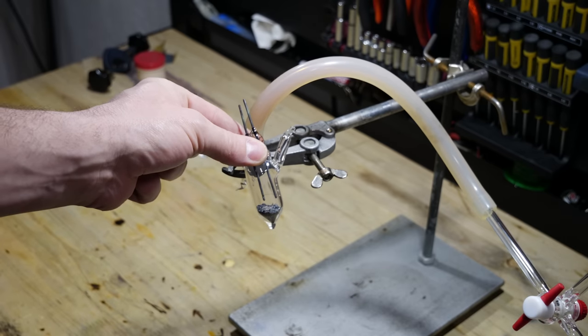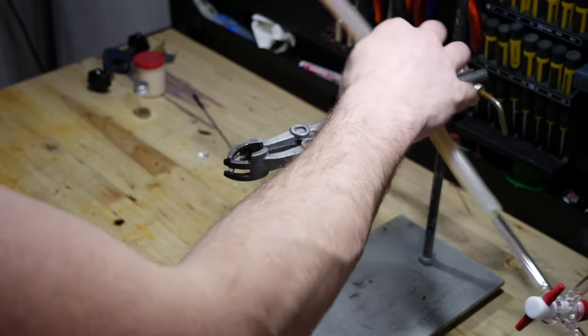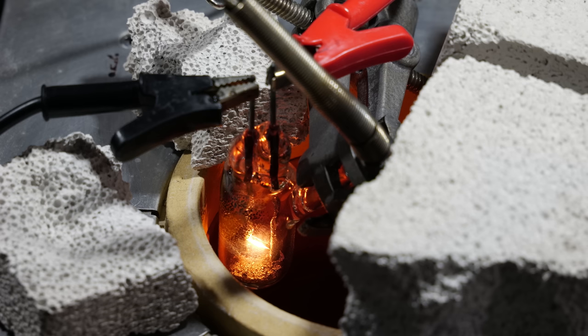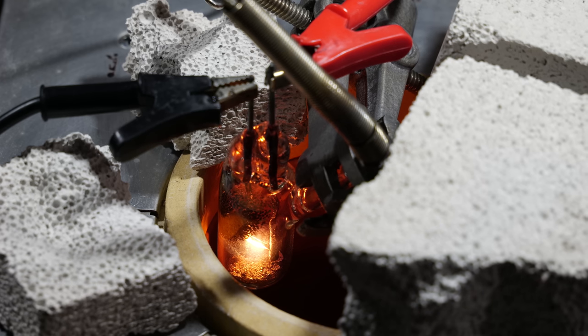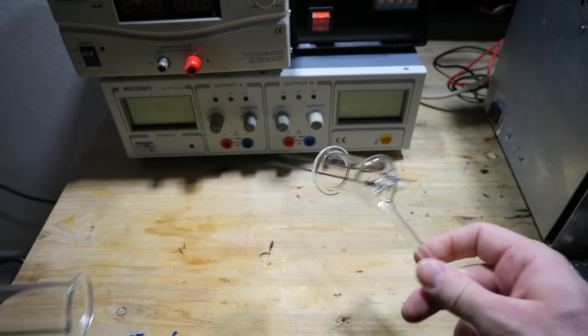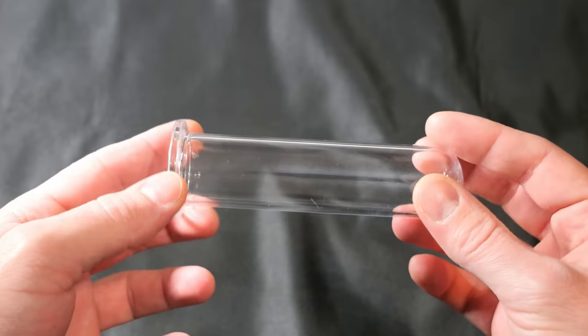At first, I built one-way glass reactors with a tungsten feed-through, but I still have to figure a lot of stuff out, and if the tungsten wire breaks or gets eroded by the reaction, I can throw the whole reaction vessel away and spend another hour to make a new one. This meant my disposable glass reactors were not the way to go. I needed a reaction vessel made out of glass which I can easily open and close again to replace the filament, and which can hold a vacuum.